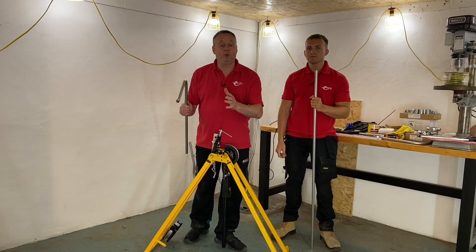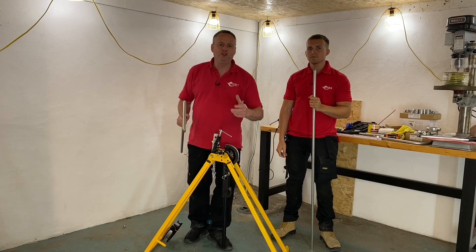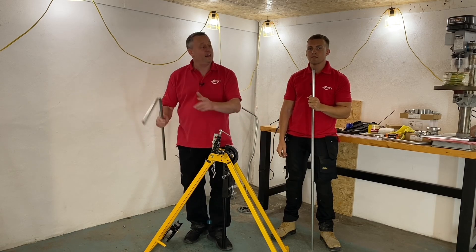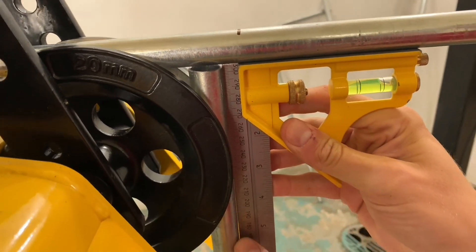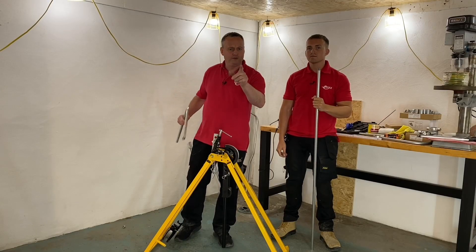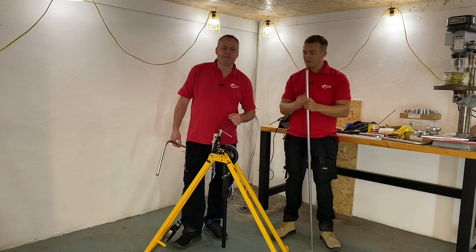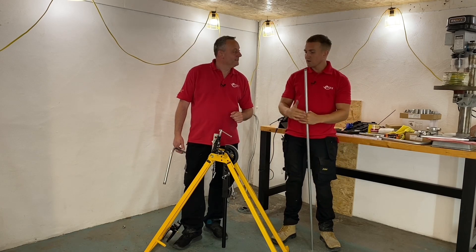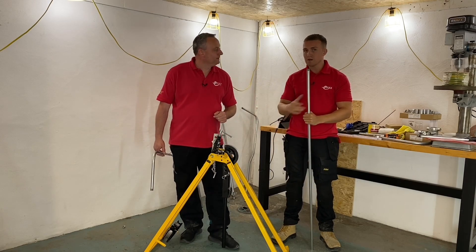In this video, me and Jake continue a series of videos looking at steel conduit. We've gone through the conduit bending machine, boxes, fixings, and threading. In the last video we put a bend in to an exact measurement from the back of the bend to the end of the conduit at 300mm, but I left you with a challenge. Jake, what was that challenge? You gave me a challenge of bending a length over a metre - you said you think it's going to hit the floor. I'm going to show you how to overcome that problem.